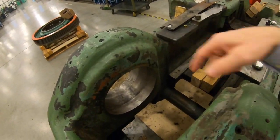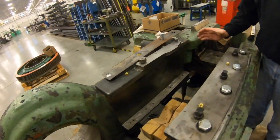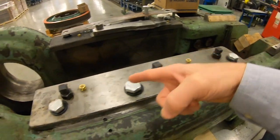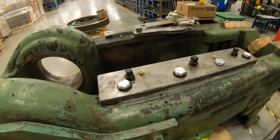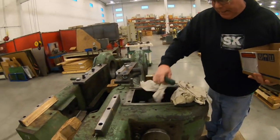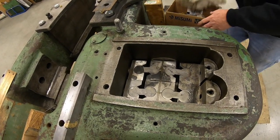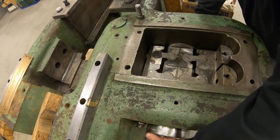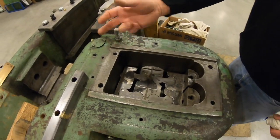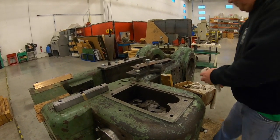You basically have a crankshaft like an engine block crankshaft, with a ram going this way — the connecting rod, the con rod — and a two-position ram that runs up and down off of that eccentric in the middle. It looks like you've already fitted some of your oil lines. We have some of the oil lines on, and we've already gone through the locking mechanism for the ram. Here's the locking mechanism — it runs off the shaft, and it actually goes and locks the way it's supposed to. This will have an oil dripper that comes out into a pan and then we'll recoup the oil.